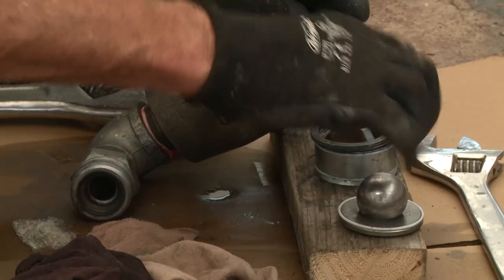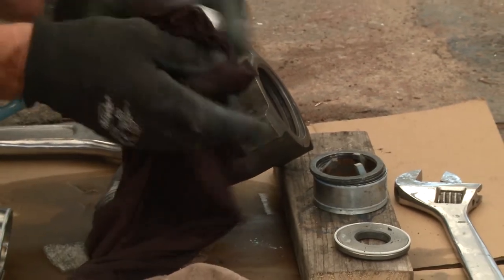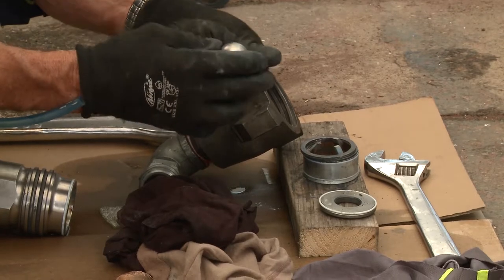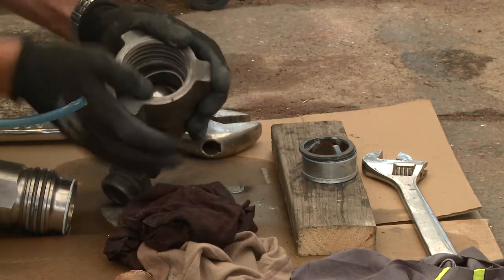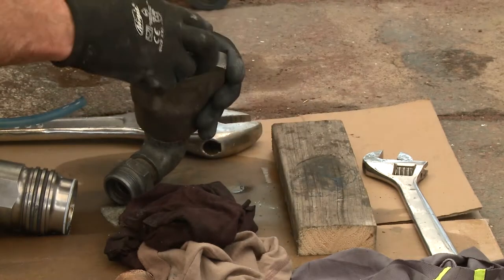This particular o-ring goes on the top of the seat, then the cage sits on the seat and seals. Inside the chamber you can see the stack-up: there's a taper on the seat where the o-ring sits, a larger face on the bottom of the cage sitting on that o-ring, another sealing ring, another sealing ring, and the three shims — that's your foot valve. Inspect the ball for any damage, dents, or scars. By eye this one looks quite good.